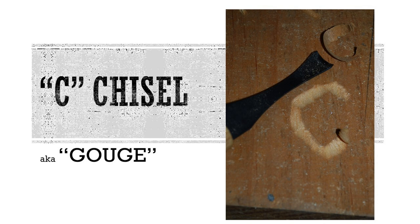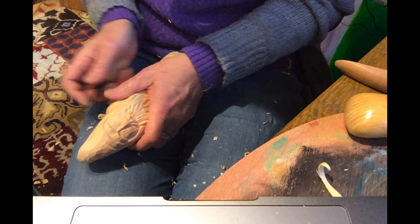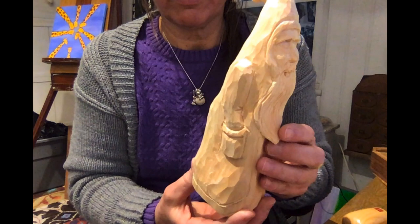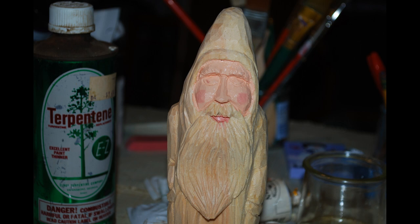Use the V-chisel to cut in details around the face and the beard. Use a gouge or the C-shaped chisel to remove larger areas of wood. When the gouge is held at a steeper angle, a cupped texture remains, which is good near the arms and around the hood. Use the knife to round hard edges and clean the V-cuts as needed. After the whole figure is carved, look at it from all sides to be sure it appears balanced and ready to finish. If the face or cloak has more texture than desired, use sandpaper to lightly smooth those areas — but remember, this is a wood carving, so it is good to have some chisel marks. If a piece of wood gets chipped off and cannot easily be repaired by carving deeper, wood can be fixed with glue.